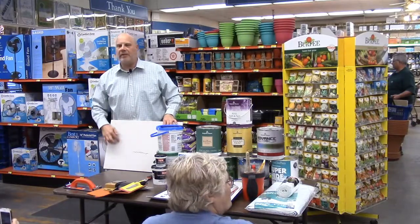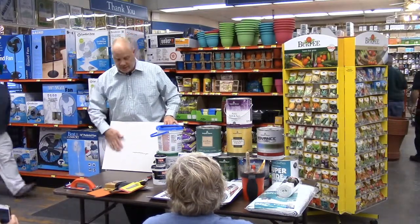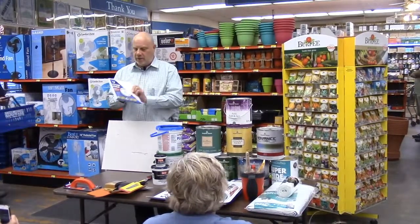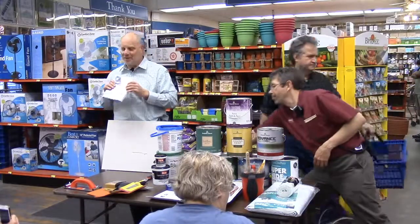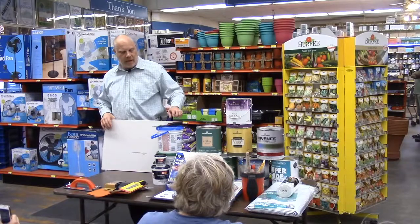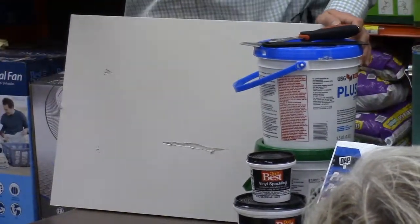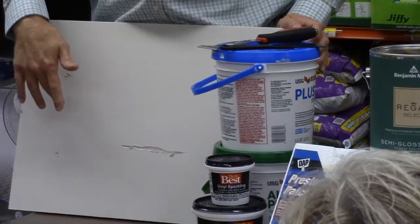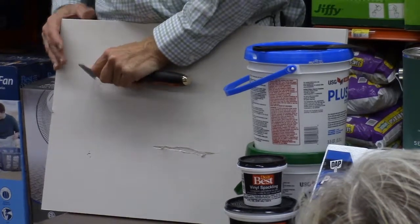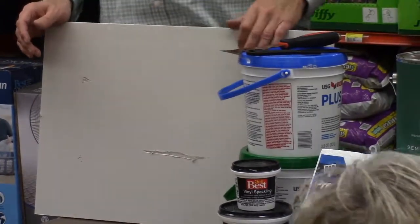These are very small repairs resembling what a lot of us see with little nail holes in the drywall. Most of the time these don't require anything special other than a top coat of patch, maybe a second coat with a light sanding. One trick I've picked up is that a lot of times, especially with nail holes, the paper from the drywall will be sticking up when the nail is removed. You want that flush or removed — just take a pencil, pen, or tool and poke where the nail was to set it just below the surface, because you don't want those hairs sticking up after you patch it.